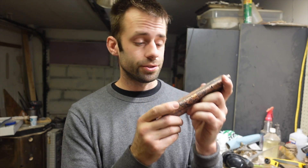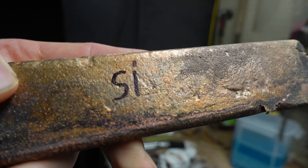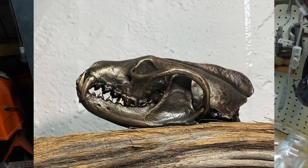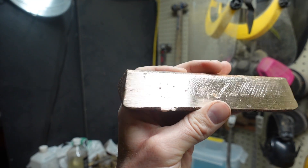And that's how you make silicon bronze. If you want a stronger bronze, aluminum bronze has a lot more strength. Each bronze has its own properties — there's aluminum bronze, silicon bronze, tin bronze, phosphorus bronze, lead bronze, arsenic bronze, all kinds of different bronzes. So yes, bronze is copper and tin, but it's also copper and silicon, and a lot of different other recipes. I always write on my ingots to signify whether it's silicon or tin. If you're a metallurgist and have any tips to add, let me know. Thanks for watching!